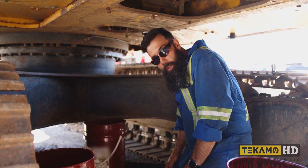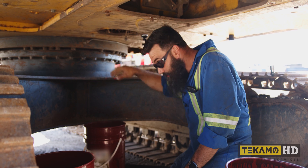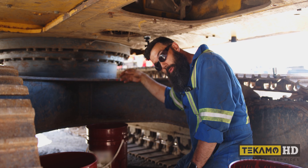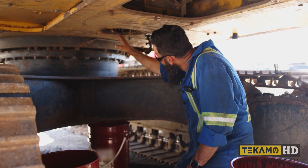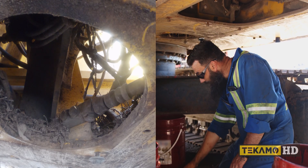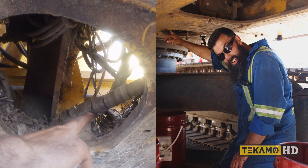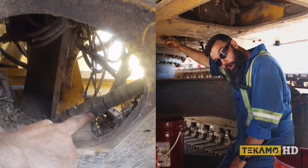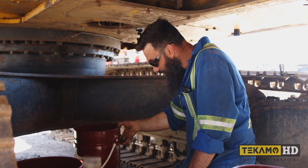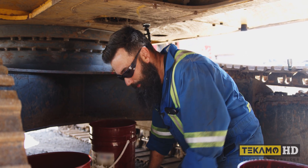To start, we're going to do the swing gearbox. It's located in front of the control valve before the boom from the top, but the drain line runs underneath the control valve, so it's accessible from the rear of the machine. It takes a 22 millimeter — or a 7/8 will also work. I'm going to pull that plug and let it drain. I've got an extra catch pan here because there's a breeze, so it's bound to make a bit of a mess.